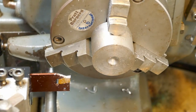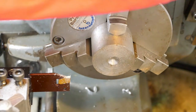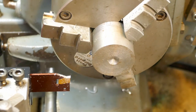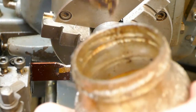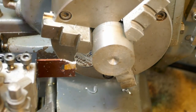I've just fitted a piece of steel to the chuck — this is of an unknown grade. I'm going to reduce the spindle speed slightly for this. I'm not going to bother facing it off this time, I don't think it's really necessary, but I am going to be using some cutting fluid. Here's the jar of cutting fluid, so let's have a go and see how it works.